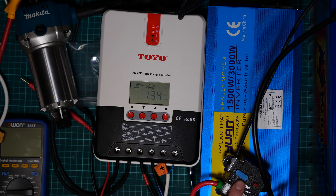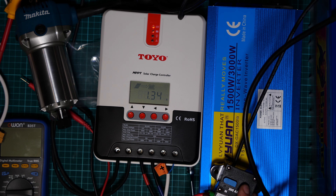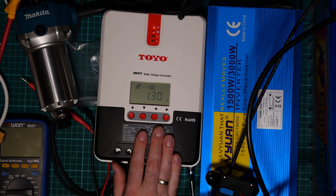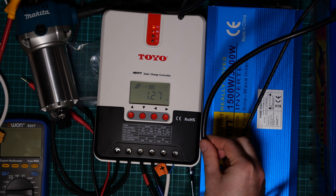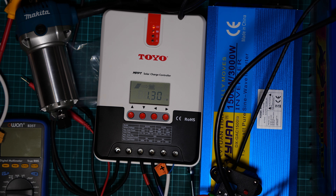I inserted a 300 amp fuse — I know it's a little bit over what I need. These are resettable fuses. My plan is to supply an 800 watt water pump in the garden as an alternative to the 12 volt setup, for when we need more water quickly. It's in parallel to the inverter, using 16 square millimeter power cords, with the minus to the black and the plus to the inside of the fuse, going down to the inverter.